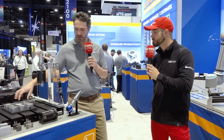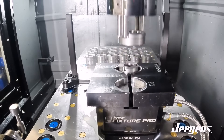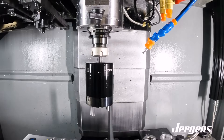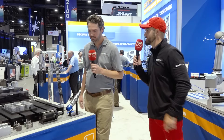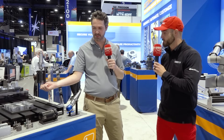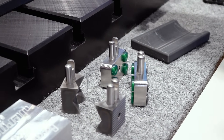You can store your parts on the table, and an operator using a system like this could, in theory, set up multiple machines they could tend to while this is doing the loading and unloading of the parts, or you increase that productivity with lights-out manufacturing when you don't have an operator presence. What excites me the most is just how simple and easy it is to use. We talk about the gripper systems — there's a quick change insert so you can go from a finger style to a universal style with a serrated and soft elastomer pad. We have a machinable setup, so it's very quick and easy for the operator to get going and configure this to whatever types of parts they need.